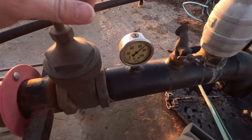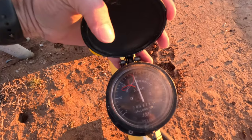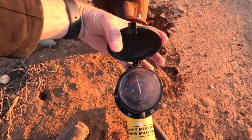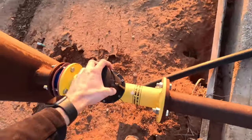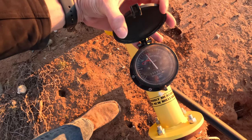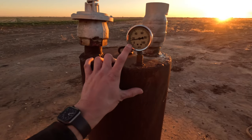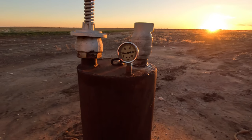There's water — it's actually making good pressure, but this one needs to be squeezed to 60. We're currently getting — if that's accurate — 150 gallons a minute squeezed at 60 pounds. That means there's at least a 20 horse in there, and there's not a 20 horse in there — I believe there's a 10 horse. I almost don't believe 150 gallons a minute. There's good water, currently 17 pounds of pressure in the line. I'm gonna go turn on that one in the corner too — I think I can handle at least 25 pounds of pressure, so this isn't too bad yet.